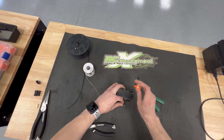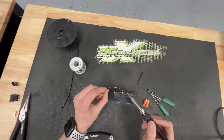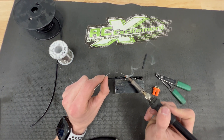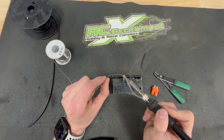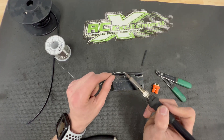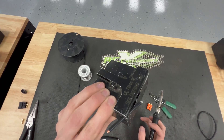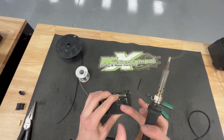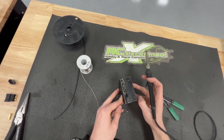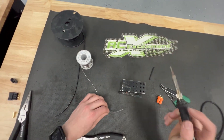Twist that and take the connector out of the soldering jig. The soldering jig is made out of steel, which makes it really easy. What I do is put the iron in the back and then just touch the tip of it, and then all you're doing is feeding solder in from the front — it's melting all the way through the connector. One of the big things is you want to make sure on that solder joint you don't have any of the wires showing. It is totally okay if you have a little bit too much solder.